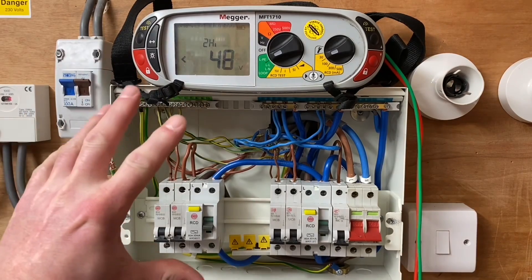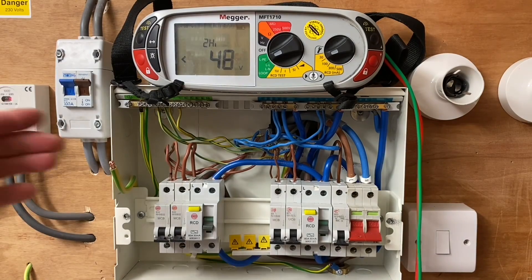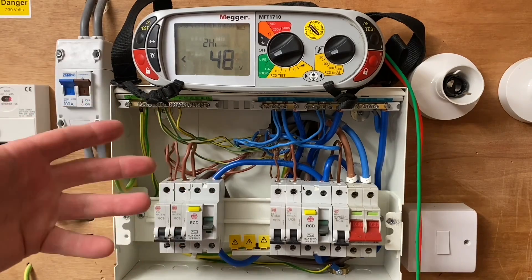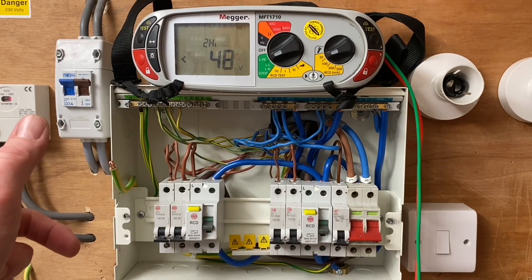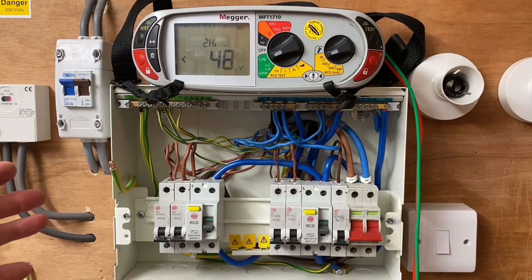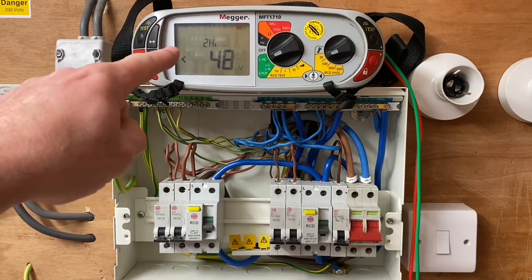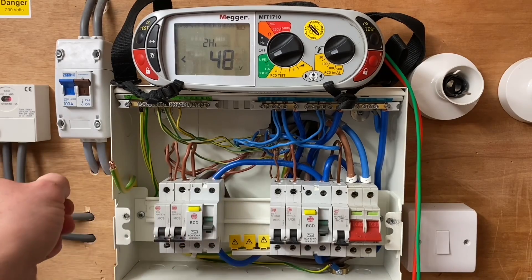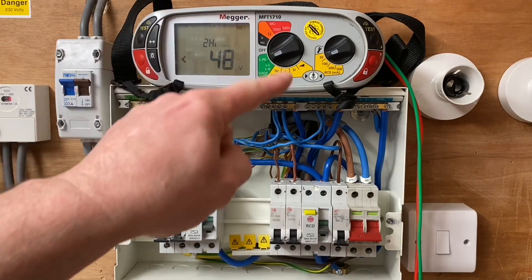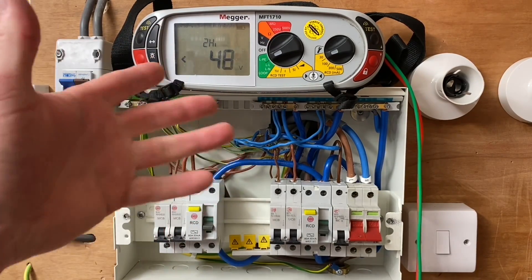This training rig is not the origin of the installation, so we might find this reading is higher than that set by the earthing arrangement. We might say to the students to presume the earthing arrangement is TNS and they have to suggest whether the result is in or out, or TNCS. It's actually mocked up to be a TNCS. Are we expecting this reading to fall below the maximum value allowed? No, we're not - we've seen many times where this reading will be greater than 0.35 ohms because this is not the origin of the installation we're mimicking. It's how we carry out the test that's really important.